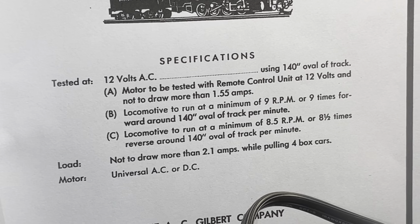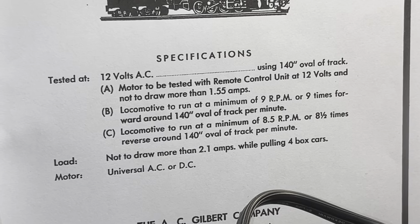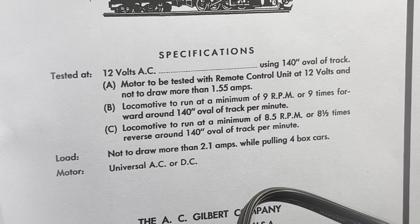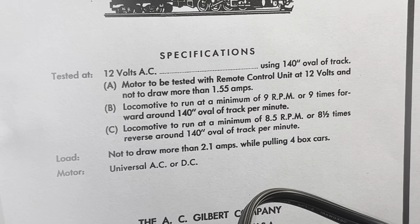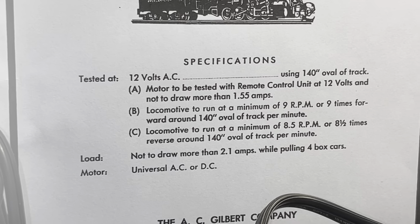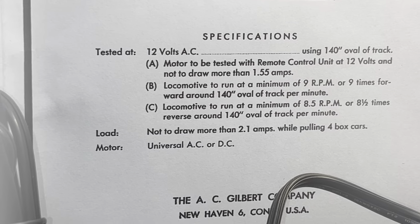Elevated heat, for example, could damage plastic. It could impact wire insulation, including the motors. The armature already has the reputation of an inability to disperse heat, and it might cause it to build up even greater heat. It can impact lubrication and could lead to degradation in motor performance. Those are just some examples of what increased amperage could do, and that's why I think it is so important to pay attention to these specifications.